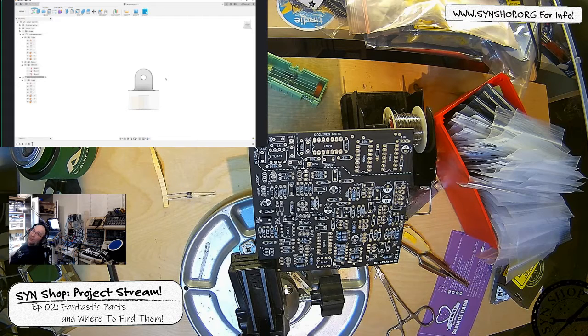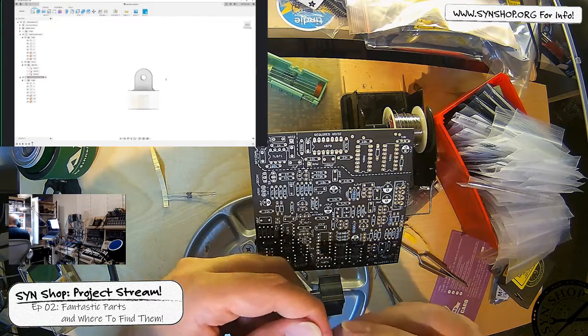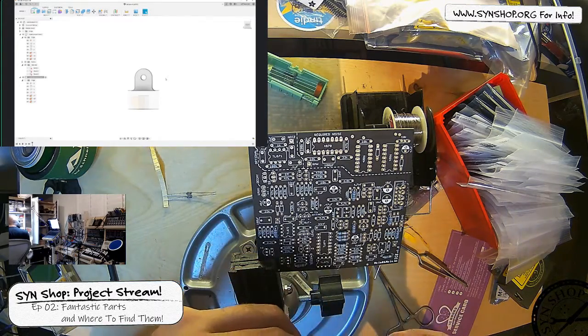You could use the same insert and then just get a 1/4-20, basically chop the head off a 1/4-20 that's twice as long as you need. Screw it in, maybe some red Loctite or something like that. Yeah, I was actually just thinking about Loctite as might be an option. Yep. Loctite is always an option.